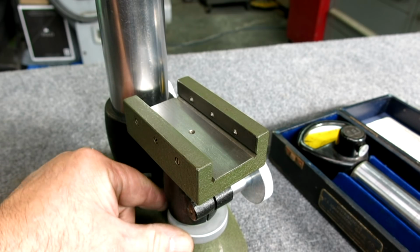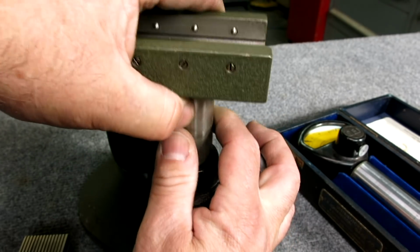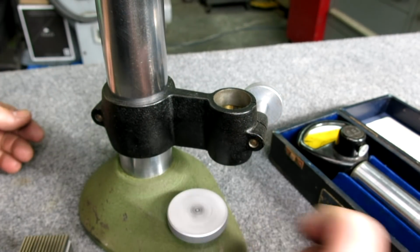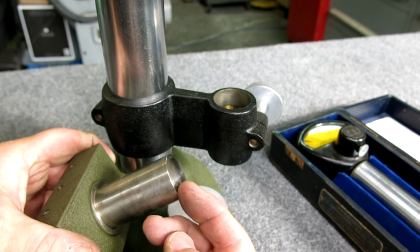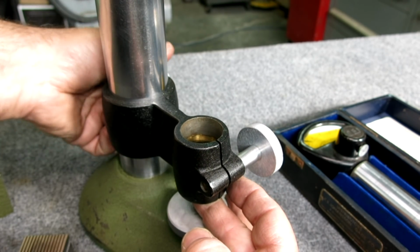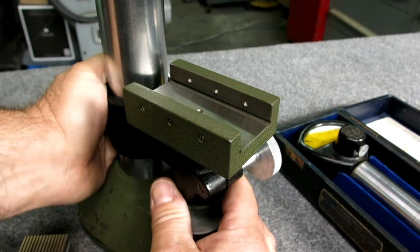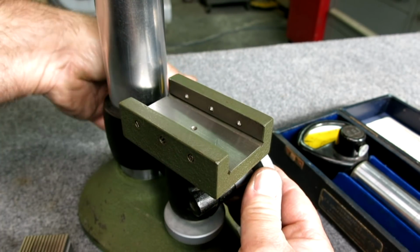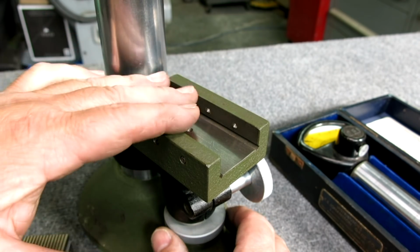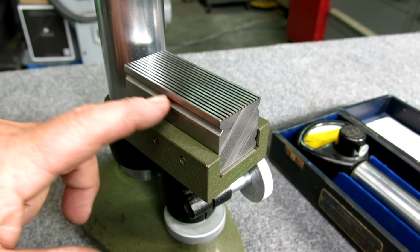And then it has a fine adjust mechanism down here, and let's pop that out of there. So, and there's the relief thing again there. Let's slide this aside. So it's like a micrometer screw here, and it acts on the bottom of this, and that's how you make your fine adjustment there. So instead of a rack and pinion or some, I don't know, kind of awkward setup there, what's nice about this is it's all acting right on the center line. So we lock that down, we leave that loose, and then we make micrometer adjustments here to null the indicator out. So pretty cool.